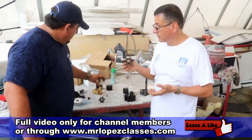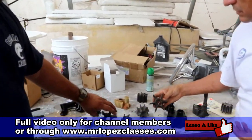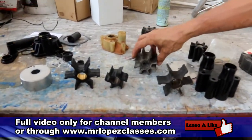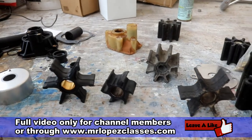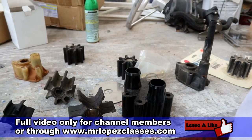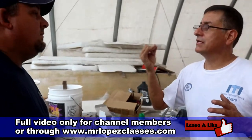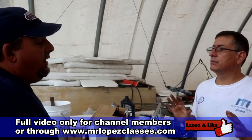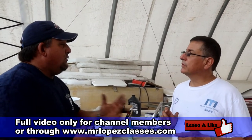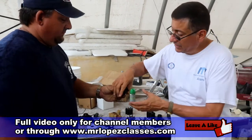Look at the different types of water pump impellers. You have small impellers, big impellers, different triangular impellers — so many different types. It all depends on the model and what the manufacturer specs in the manual. The enemy of impellers, especially in outboards, is air and sand. An impeller is like a double-edged sword: if you use it too much, it wears like this.